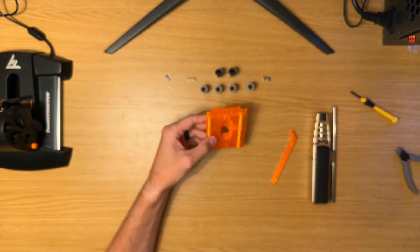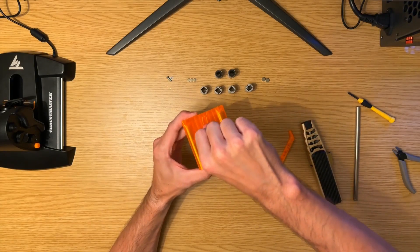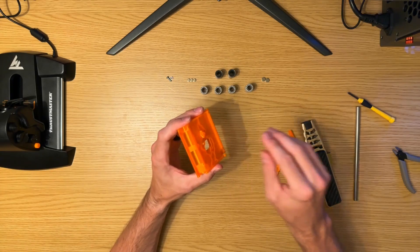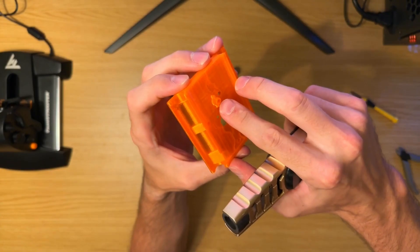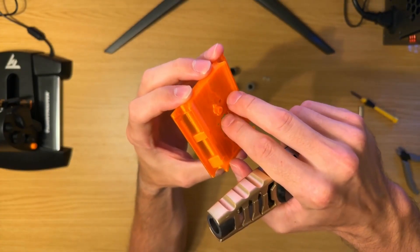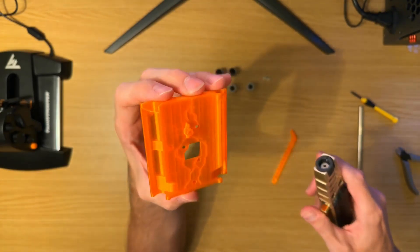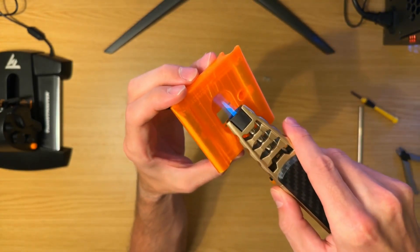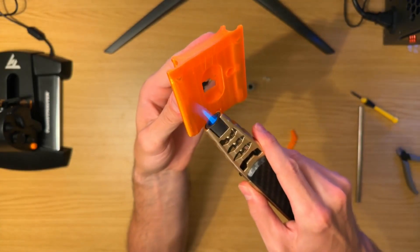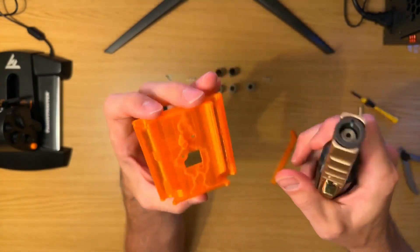I've removed all the major globs. There's an overhang here that we can heat up and press with your finger, and then the little knob that the swing arm mounts to — we can also heat that up and push it into place with a fingernail. Very quick little flash with the flame, then push my fingernail up on that, and on the lower one. Same thing for this overhang right here — just shoot a little flame up in there and press it into place. Any other flaming I do is just to get rid of surface defects, for aesthetics. The functional deburring has been accomplished at this point.